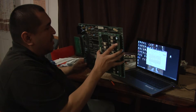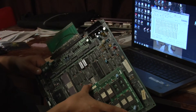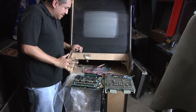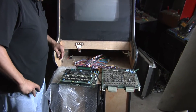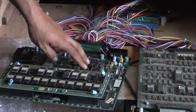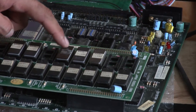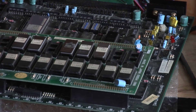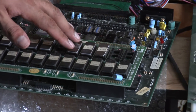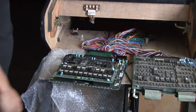All right, everything's put in — the Z80 and the newly burned ROM. Let's go back outside and see if it works. I've got the board plugged in. We changed over the original chip to the Z80 processor and also burned the new ROM for the sound. You can find Z80s on eBay for about five bucks. Once we verify it's working, I'll tape it up so it won't erase.